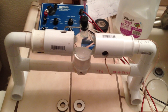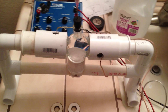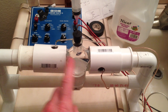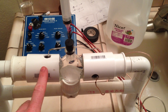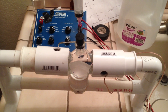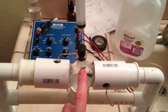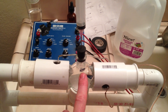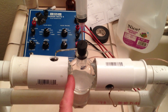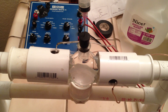This whole skeleton I've got here out of PVC pipe is not necessary. Originally I set it up hoping I'd be able to adjust the distance from the flask with these transducers inside the pipe. But trying that, I found it's definitely necessary for the transducers to be as close as possible — touching is the best result. So all I ended up doing was scooting them as close as possible and hot gluing it to the flask like in the last video.